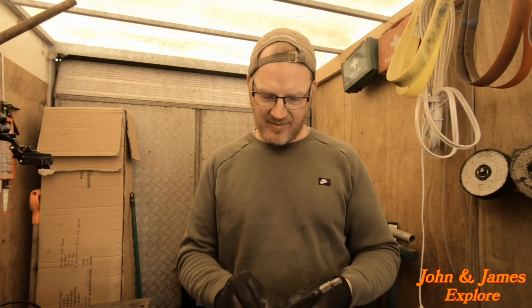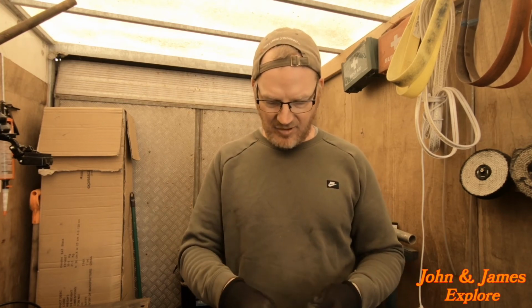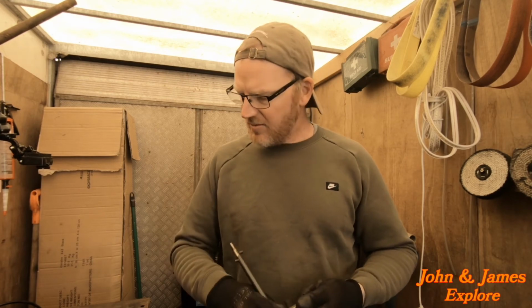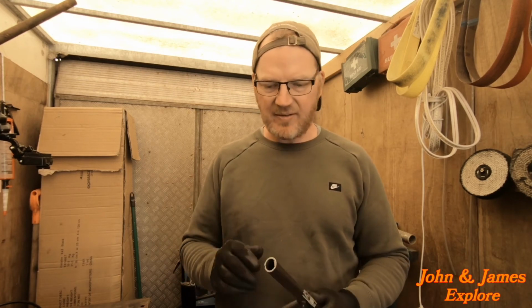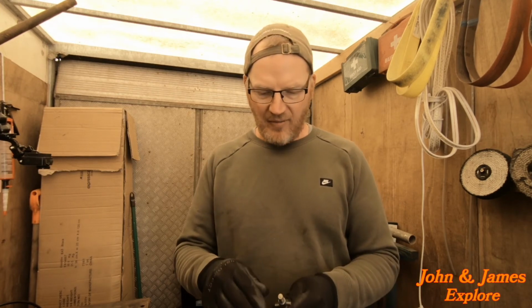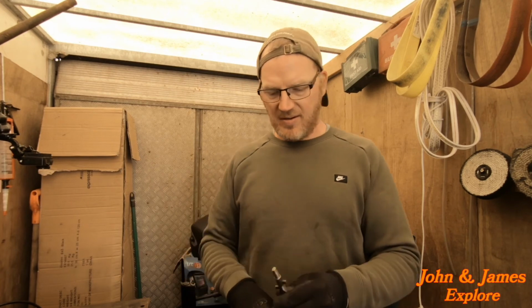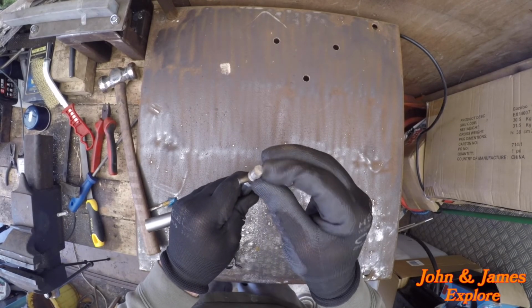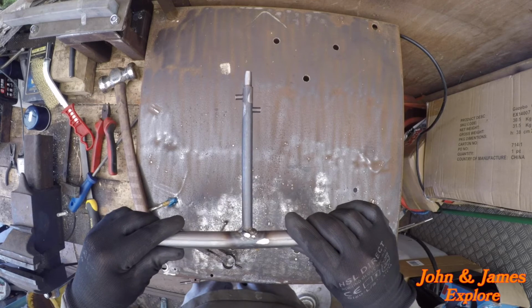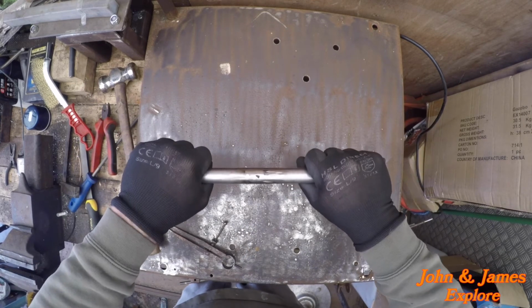there. As well, it's a little bit tatty, but I could file that up. Actually, it was a little bit of a wire on there, so I'm going to quickly just give these a file up, take these edges off on the grinder, bevel that little edge there just a little bit. As you can see, just to tidy this up. But that is the Scottish T-bar key.